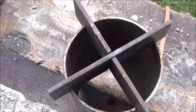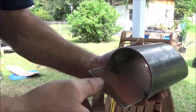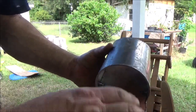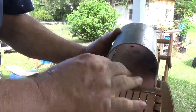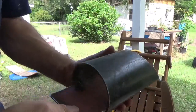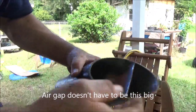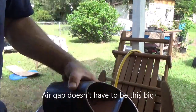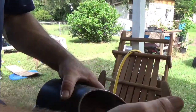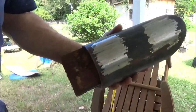It's time to do some welding. I went ahead and welded in this piece of plate — I left it sticking out a couple of inches so the wood could set on it, so you can put longer wood in there. That way the air can go in the bottom, come out here, and go up the chimney. The wood would burn right in this area here and the ash would fall down. I cleaned off two spots to weld the feet on.